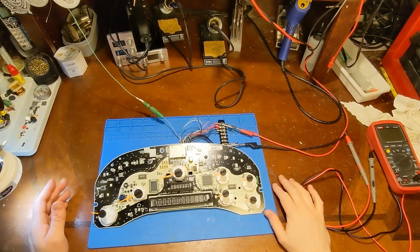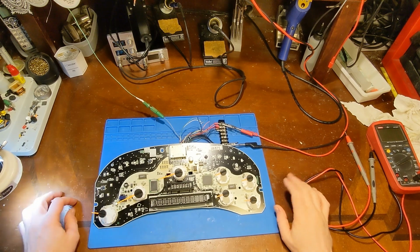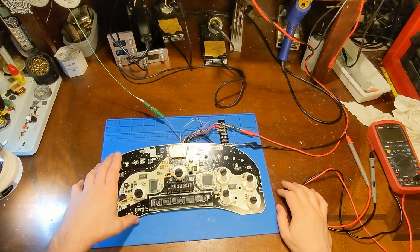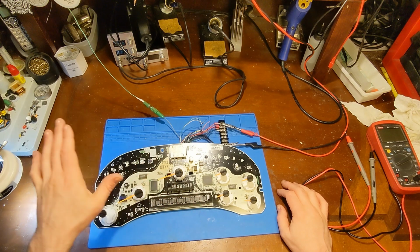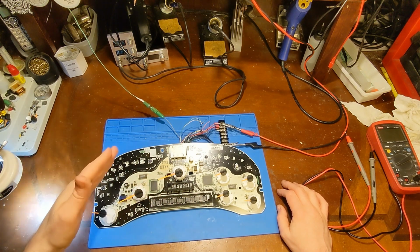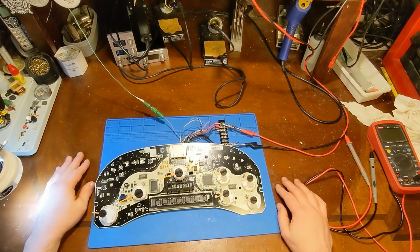Today's video is just going to be a quick refresher reminder on a problem that I covered a few years ago. Now this is going to be about a 2005 board with no communication. You're mainly going to see this with 2005 but not 2003 or 2004 because that's a different board revision. Now I have seen this in 2006 and 2007. They're just not as popular as clusters, or must not have made as many as 05.